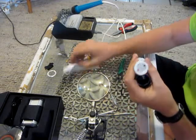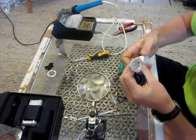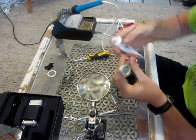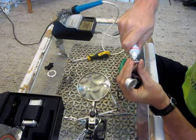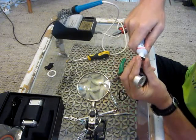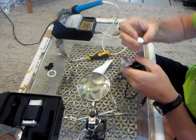You need to put thermal paste on the back of the LED. Don't put too much — just enough to cover the base, spread out so there is nice contact.